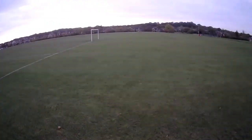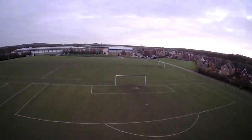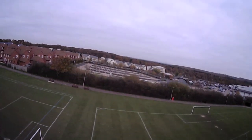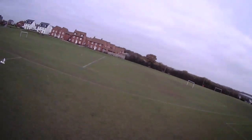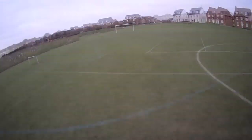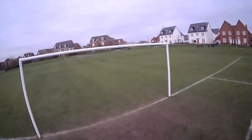Today I went out again and had a mess around with the KK settings, trying to dial down the pitch and roll gains - if anything it got a bit wobblier. There's still the wobble and a little vibration transfer, which is not ideal. I tested maneuverability by trying to chase a seagull, and it felt pretty good despite the wobbles - obviously the seagull won, but he is a bird. You can't fly FPV in a field with goalposts without flying through them, so I did exactly that and it was a lot of fun.